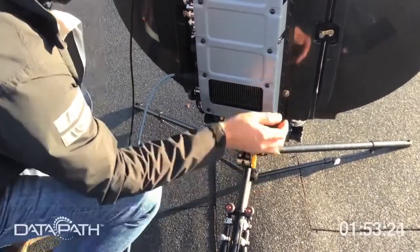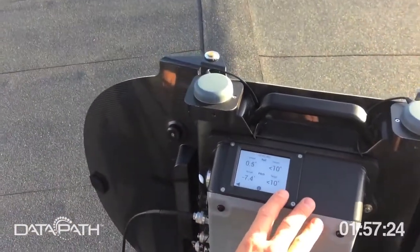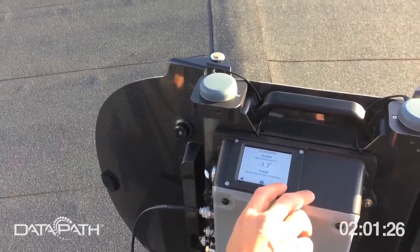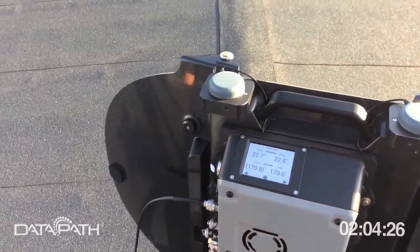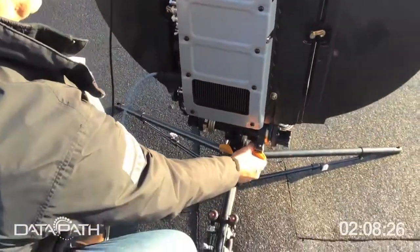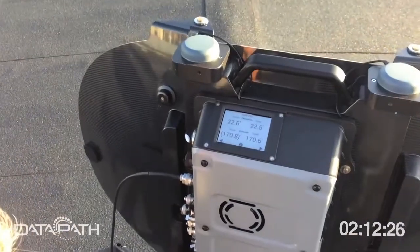Fine-tuning is easy too. You go back to 171, take the next picture, and you see roll and pitch — you're within the limit. Polarization needs to be adjusted afterwards. You check your pointing: azimuth is okay, but you need to correct elevation a bit.